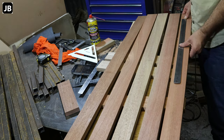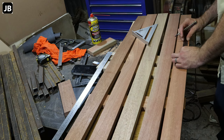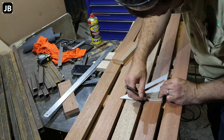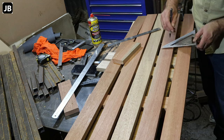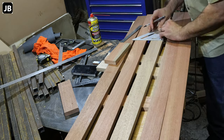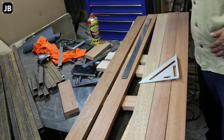Making sure we mark out all the boards correctly. You'll see me burn the first 100 millimeters or four inches of the rule and then working from there — just gives a more accurate reading. Normally I would use a wooden pencil, but I'm using a mechanical pencil. I don't like using a mechanical pencil on wood because it tends to scribe into the wood rather than make a mark on the surface, and then you sand your ass off getting the scribe marks out. Make sure you use very light strokes with a mechanical pencil on wood and do not press down.